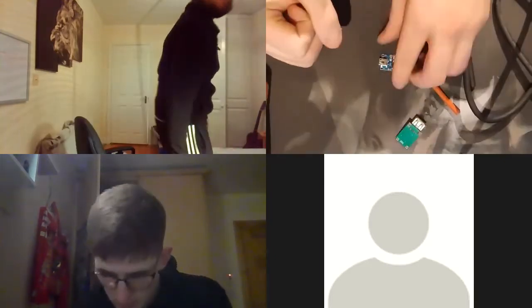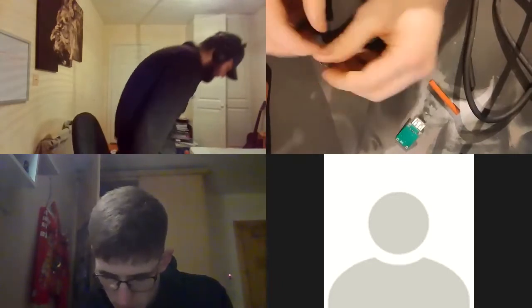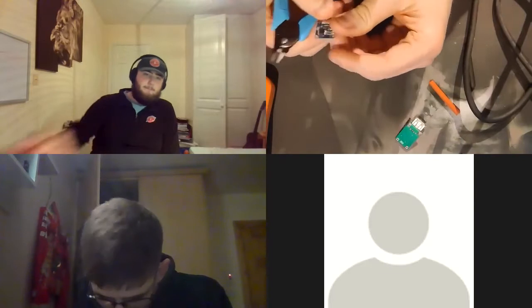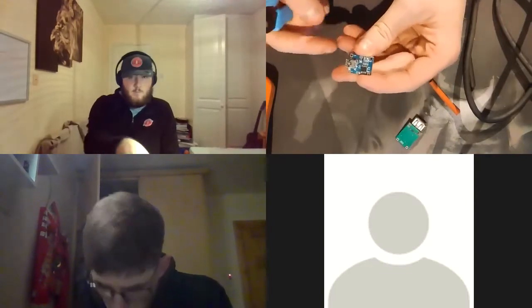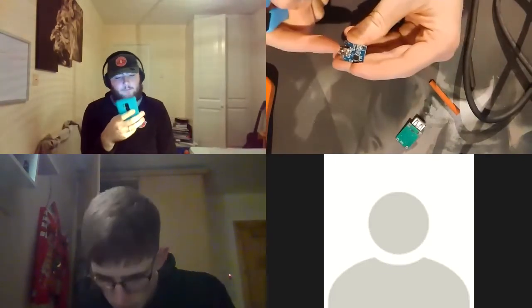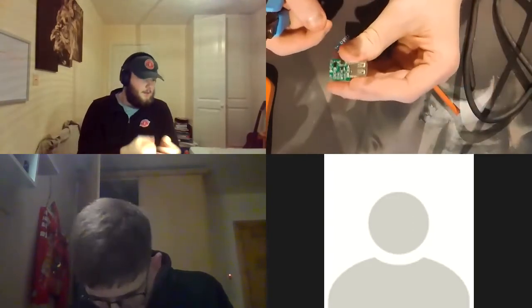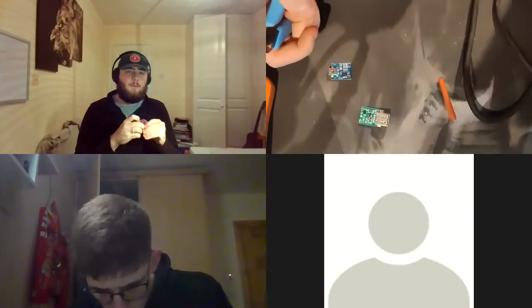Back. Had to do some research there for a bit. But yes, anyway. Let me cut some more cables. So yeah, we're soldering to the battery end because I misspoke. Power will be coming in from the wall through this end, charging the 18650, and we'll be pulling power from this end. So got that backwards.